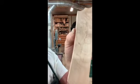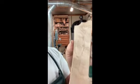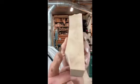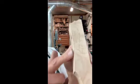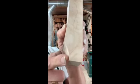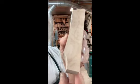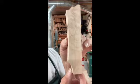The more you can refine them, the better, and I believe the closer you can come to hitting a bullseye in your target, the better off you are every time. But keep in mind that while this surface and these curves may be less critical, the absolutely critical point is right here. This point must be exactly half the width of the fingerboard from this point. So now we have half of a headpiece.